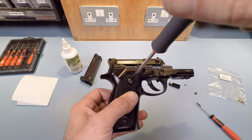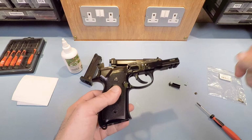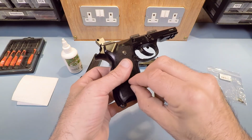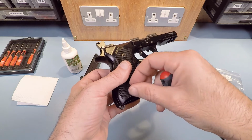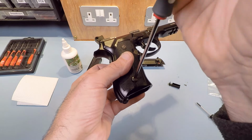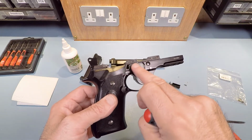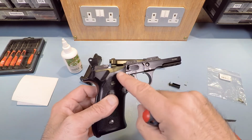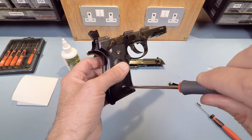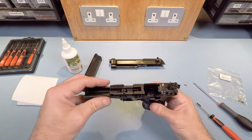So it's going to go, screw these down. You don't want to go again too tight on these, because the tolerances on these mean that you can pinch the grip up on the mechanical parts. I've noticed that as well, stops it from sliding back. So a lot of these movement parts here get caught with the grip if you make it too tight. So you just want to nip it up just a little bit just to hold it in place. That's all you need. Okay, so now we can return our focus to the bit at the top here.